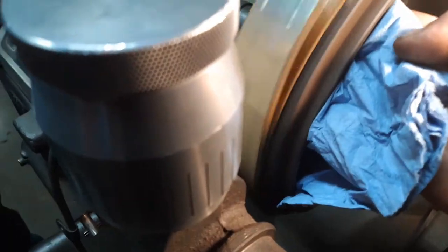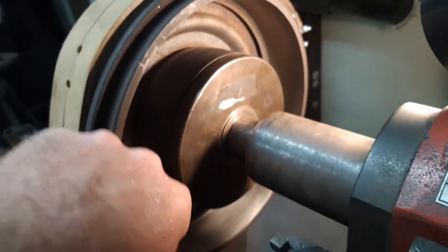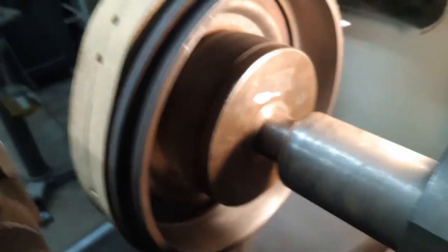I'll brush the debris out so we can see the finish. If we look close down in there, we should get a cross-hatching type finish — it's especially difficult to catch on camera, but we can see it in person. You'll notice the cross-hatching, sort of like X's, at an intersection of about 45 degrees. That's going to give it our non-directional finish, so when we put it on the car it shouldn't cause any pulls. Also, that cross-hatching is a nice surface to help the brake shoes, or if it was a rotor, the brake pads bed in. So there you go — non-directional finish.